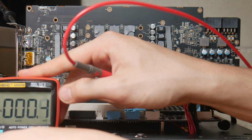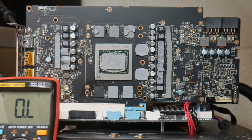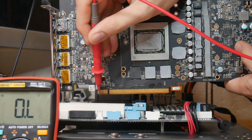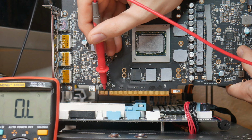base voltage rails. So we're going to go to the continuity mode, and in continuity mode, if I probe something connected to ground, like ground itself, my multimeter beeps. So, to start with, we're going to check 12 volts and 3.3 volts at the PCI Express slots. If you don't know, the first 3 pins are 12 volts, and we're perfectly good. And to check 3.3 volts, we start at this notch and we go 4 pins left.